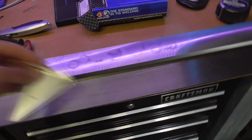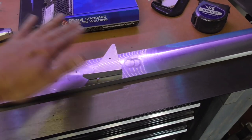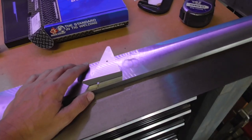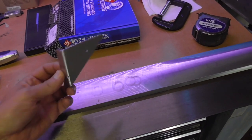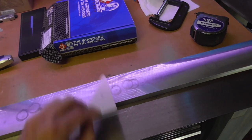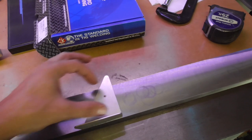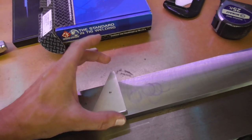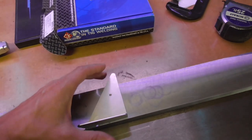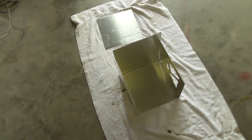Bends can be a little bit difficult because if you're just bending a line two-dimensionally on a computer screen, that's perfect, but real materials have thickness to them. So I did a couple of test bends to figure out where to draw the line to put my material in order to get the right distance — not a little bit too big or too small. That way I'd feel more comfortable with myself when I screw it up, which I did, and here's the screw-up.